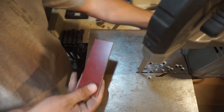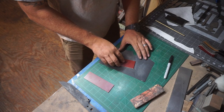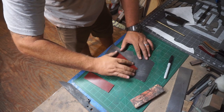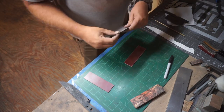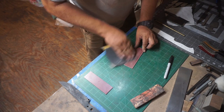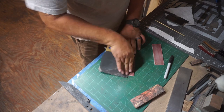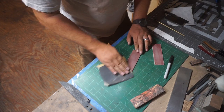Now that we got those cut, it's time to get them sanded. At first I was just moving them across sandpaper but then I thought I couldn't even see if it was working, so I switched over and started hand sanding the back side. We're doing this to create more surface area with those scratches for a better mechanical bond.